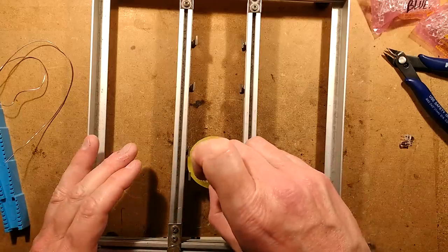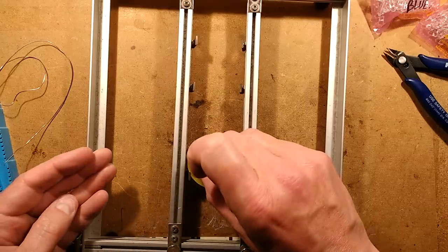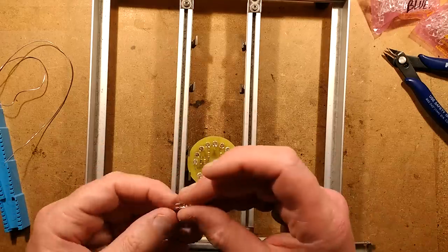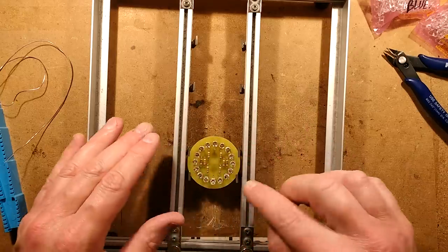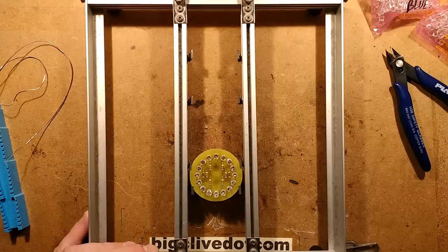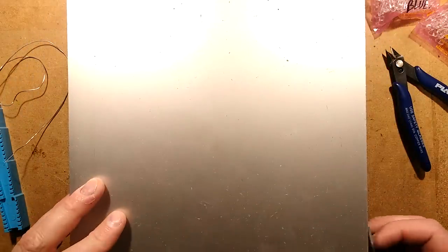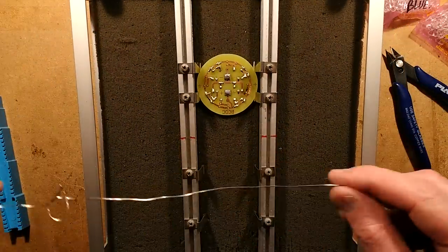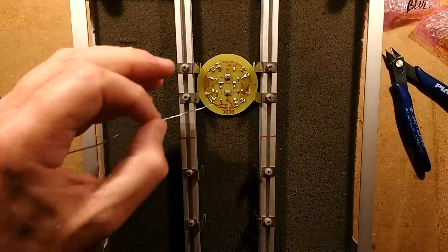Beforehand, they cheated. They'd use wavelengths that were bordering on the darker end of red and just quote the lumen values. So you thought, bought it, think it was going to be a bright LED, but it was a darker red colour. So 660 nanometer. So you thought you were getting a really bright LED, and also they tended to focus it into a really tight beam just to make it look as though, so they could quote higher intensity figures. It was all a bit cheating. If you look at the medical industry and their use of red LED therapy, red light therapy, it all tends to be based around 660 nanometers from that era, simply because that was what the bright LEDs were available in. So they used to go, yes, using the prestigious 660 nanometer wavelengths.